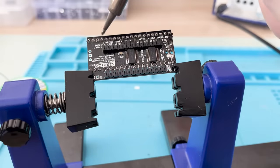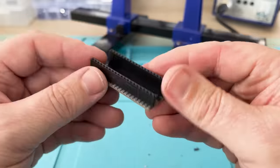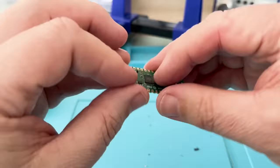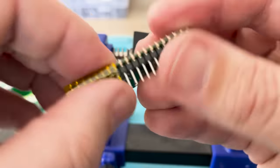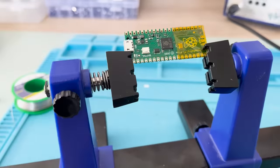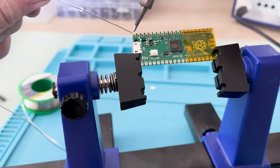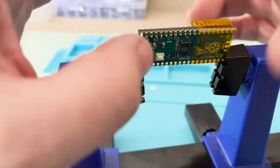Several improvements were made in the digital domain, however the major achievement was vastly more accurate emulation in the analog domain by simulation of the actual analog circuits, using detailed models of DACs, VCRs and op-amps. Op-amp transfer functions were obtained by feeding and measuring voltages directly on SID filter capacitor pins.